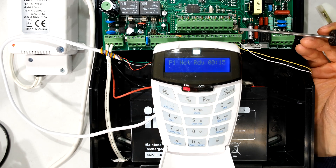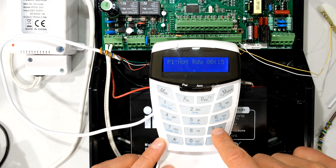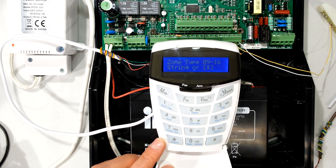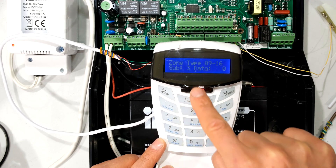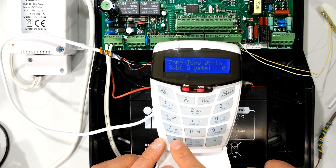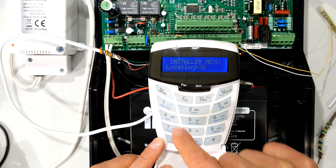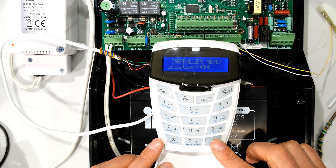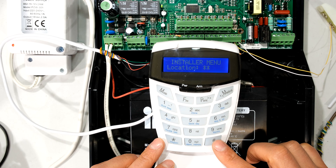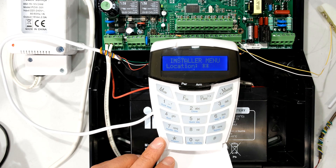What I've shown you is that when you add the plug-in expander, just do two things: go and change the zone type — press four nines then the star key, go to location 2, and there you can change the zone type for each zone (sub-location 2 is zone 10, 3 is zone 11, 4 is zone 12, 5 is zone 13, and 8 would be zone 16). Once you've done that, go to location 201 and add those zones to the partition. All of this can also be done using the IDS Swift software, which is much quicker especially if you're going to have lots of expander boards. Check out my IDS playlist for how to do that. Thanks for watching!